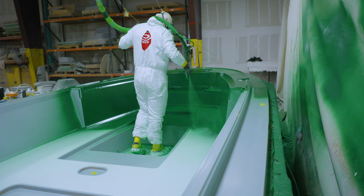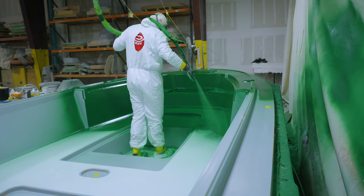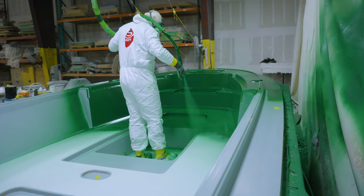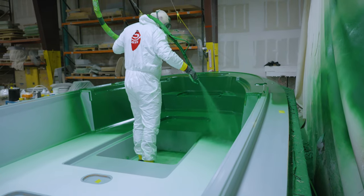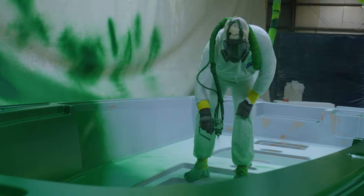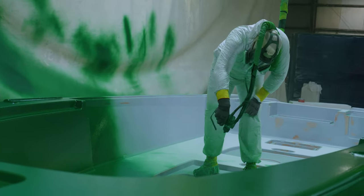Surprisingly enough, making a mold is similar to building a regular fiberglass part, and it all begins with a layer of gel coat. The gel coat you are seeing is brightly colored, and it's called tooling gel. The bright colors help to identify a bare mold once complete.